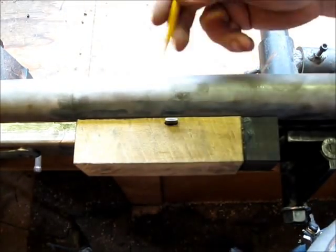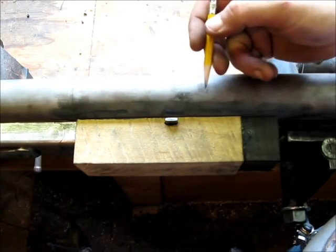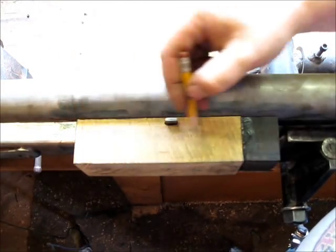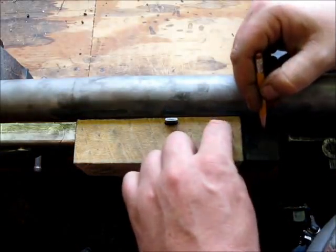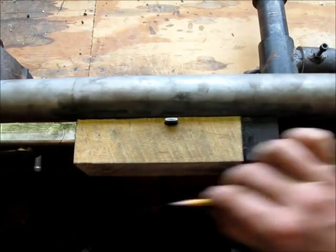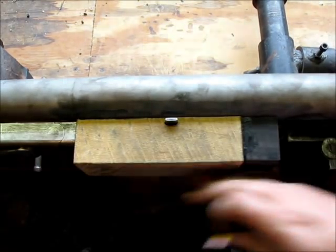It's bedded in so the surface of the wood won't shrink, expand, or contract. The next step is to run this through the bandsaw and take off this big chunk of wood here — get rid of the excess. I'll also run it through the bandsaw and take it down to the angles it needs to be to make the splinter fore-end.